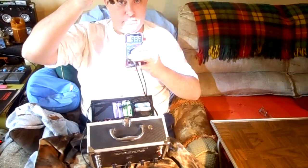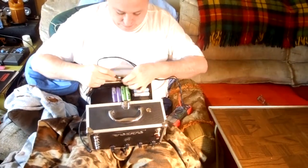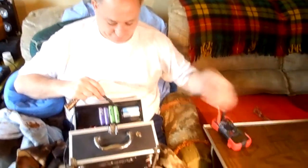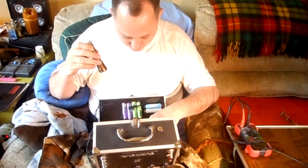Here's a multimeter and I'm going to go ahead and plug that in here — this way you can test: 16.85. This is a handy thing I built. It's banana plugs on one end, which go into your meter, and then it terminates in a DC 2.1mm female jack with one of these barrels. That's just a handy little thing that I built — a $2 eBay special that I threw together on a Saturday afternoon.